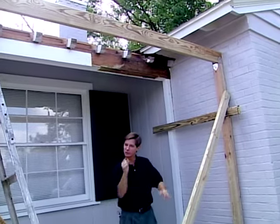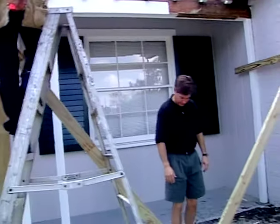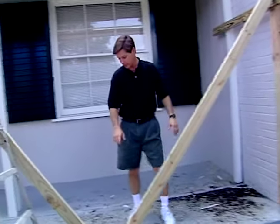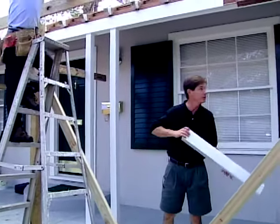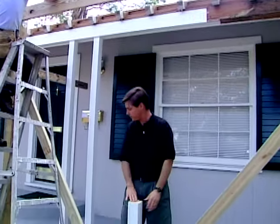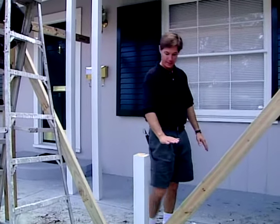We'll check it with a screwdriver or something, see how bad it is. Now, also these plates here for the four bys that are set up, we've got three on each side, but you notice we don't have a four by that goes all the way up to the header. And that's why we're gonna come in with our four by post here, a low one, that'll really support the handrail, about a 32 inch height here.